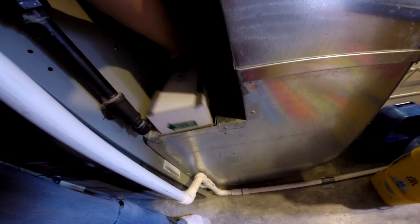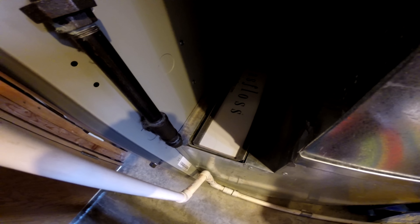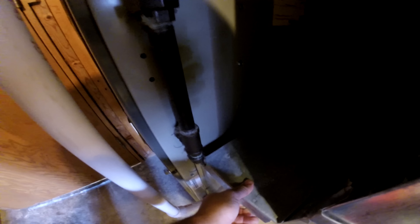You may have to back it up and push it the rest of the way. There you go — it's flush with the top. So we're ready to put the access panel back. You may not have an access panel; some air filters are a lot thinner and it just sets in there and you don't even have to remove a cover. Mine is larger, so you have a cover. And all those sounds you make, make you sound more important.